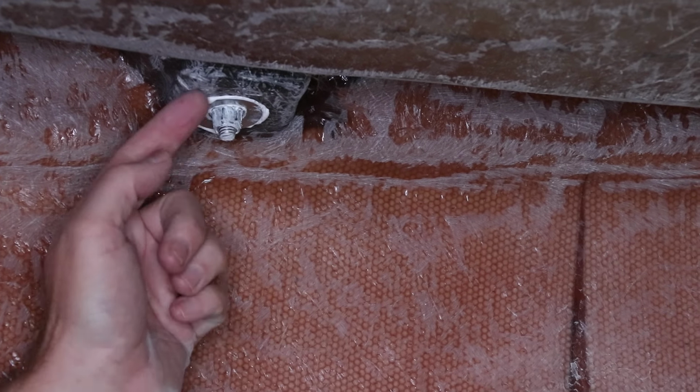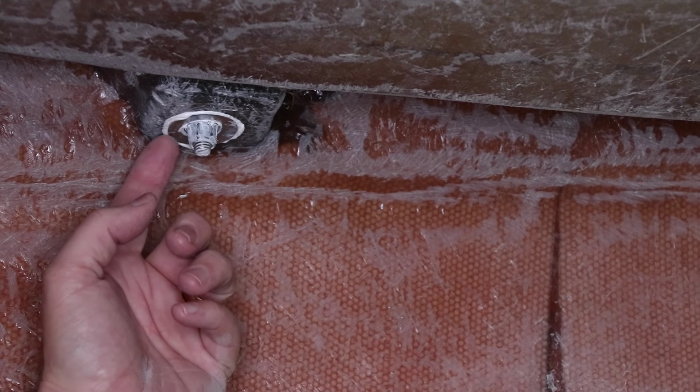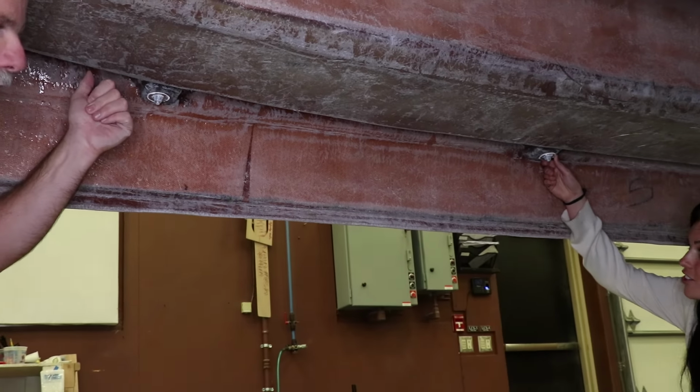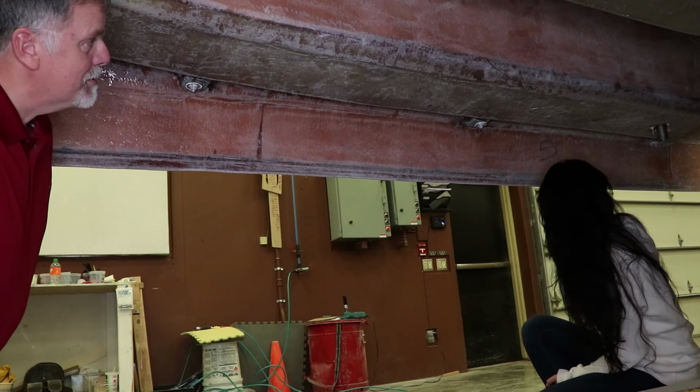We slip it through the hole, put a glob of urethane adhesive on, put a fender washer on, and then another 3/8 bolt and nut. So basically that's what holds those rails up. It's sturdy. It's really strong, and look at how often, all the way along, really solid.